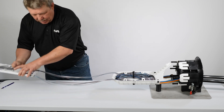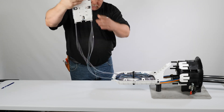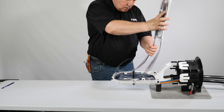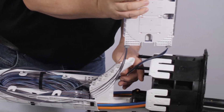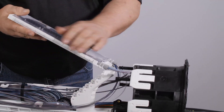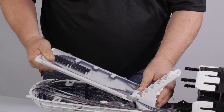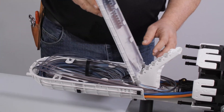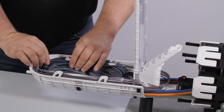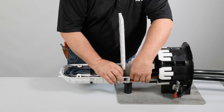Once splicing is complete and trays are covered, bring the tray to the basket and rotate for the first figure eight at the top of the basket. Bring fiber or tubes with tray behind the yoke and rotate in the opposite direction. Lower the tray to the applicable location and secure the tray in the yoke. Dress fiber or tubes in the basket and secure once all trays are installed. The fibers or tubes exiting the basket will be on the outer portion and do not interfere with the tray fiber when in raised or lowered positions.